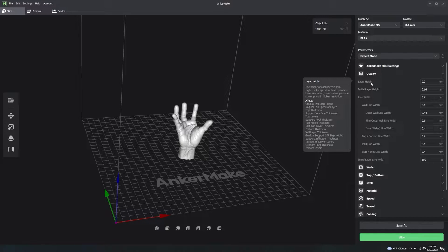You can set layer height to pretty much whatever you want. The smaller you go, the higher quality print you get; the larger you go, the lower quality. This is how thick one line of plastic is going to be. With a standard 0.4mm nozzle, your layer height will typically be 0.16, 0.2, or 0.24. For high detail use 0.16, for normal detail use 0.2, for less detail use 0.24.